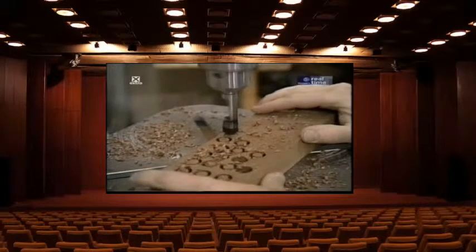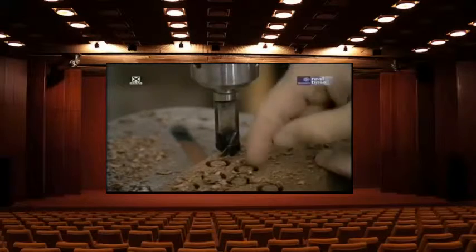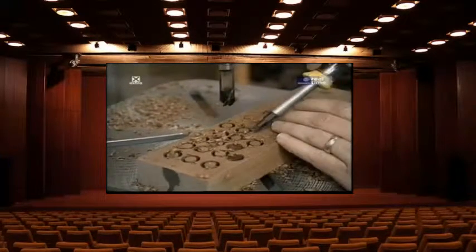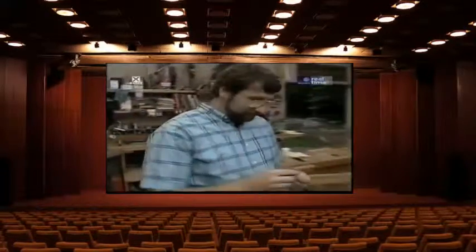What I have here set up in my drill press is a plug cutter. It's really a bit that has a hollow core, and it'll bore out these little plugs. So I've taken a piece of teak to match the rest of the project, and after they're bored, you just take a screwdriver and you pop them out. You end up with a nice little teak plug.